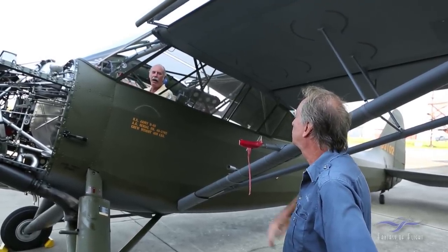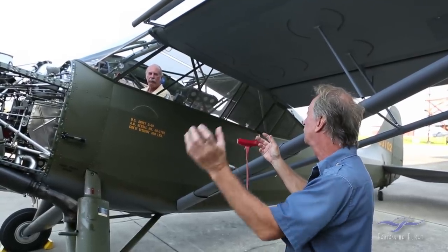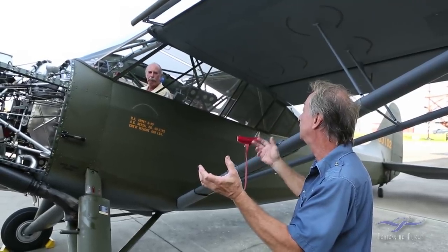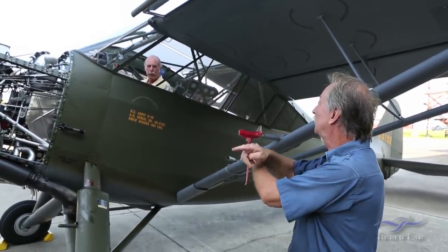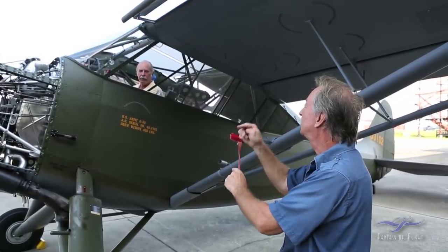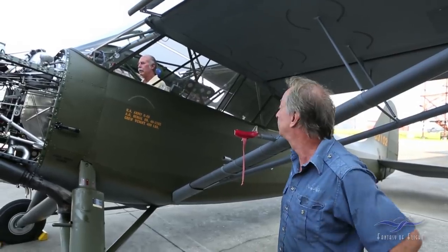Yes, there's two coils. There's one armature with two sets of coils, and the output from the left coil feeds the left side, which is the rear plugs. The output from the right side feeds the front plugs. What we've done is swapped them over. So it's the same magnet. If it's still dead on the same side, then it has to be the distributor that's killing it, because it hasn't moved. Right, okay. So now the left-hand distributor has to come off.